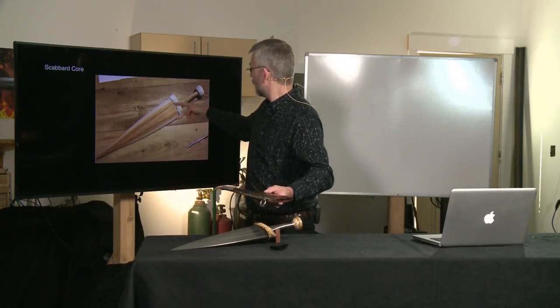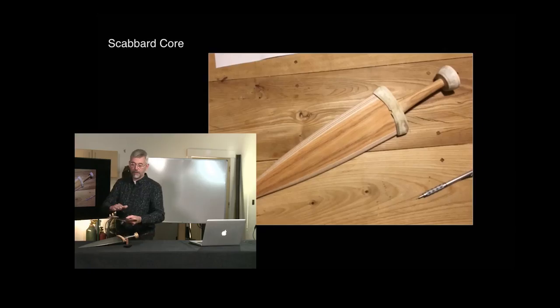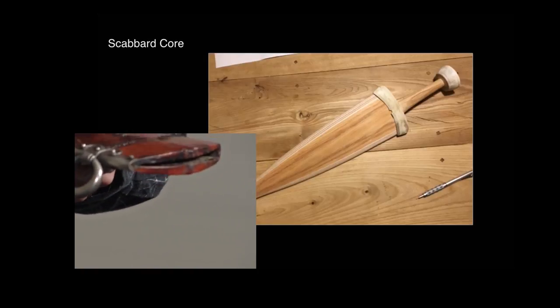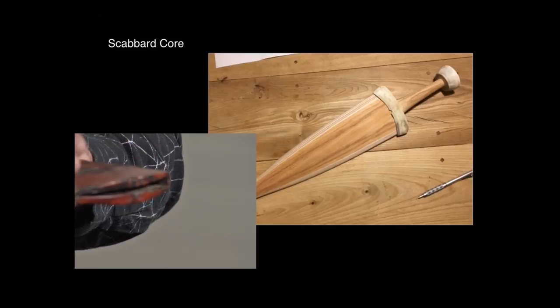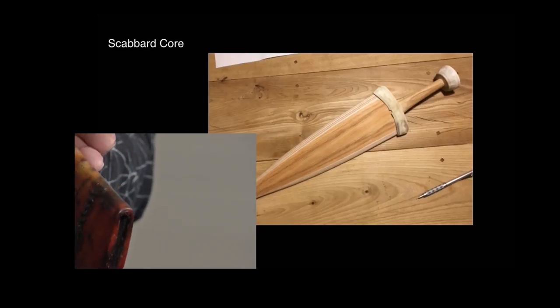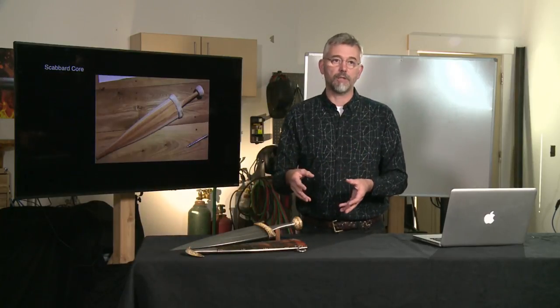You can also scrape the inside of the sides of the plywood before you glue them together to shape them slightly to the form of the blade. They're glued together over the blade to assure a snug fit. To get that slight swelling of the surface — otherwise it will look like a block made from plywood — I added strips of veneer down the center of the scabbard. Once those had been glued in place, I could scrape and rasp and sand down into a nice, pleasing slightly oval surface, both on the back and the front. The shaping of the scabbard core is really, really important for a pleasing end result.